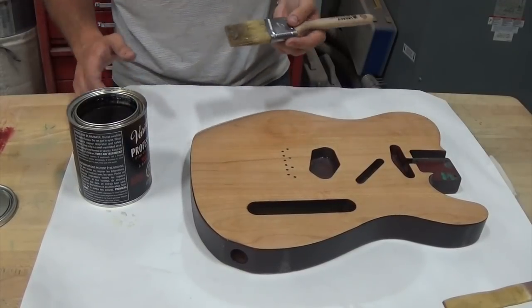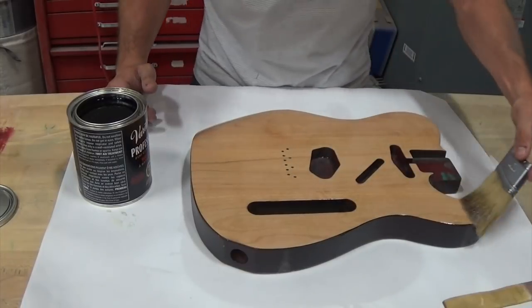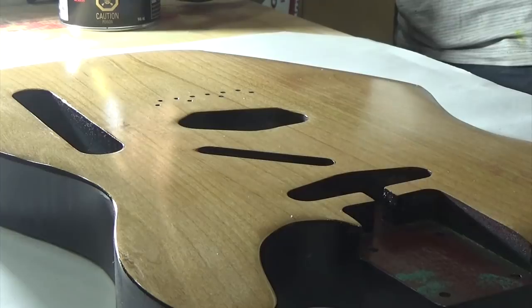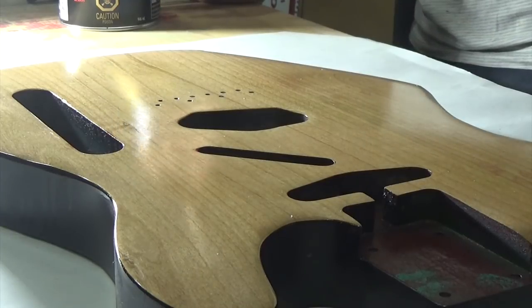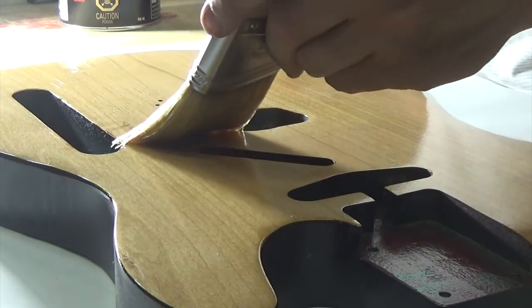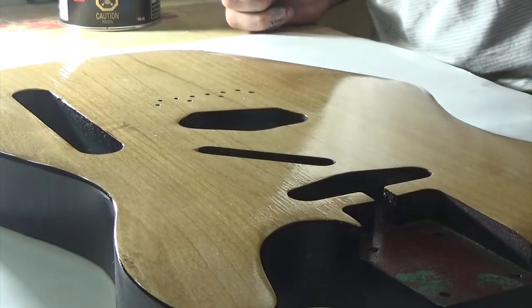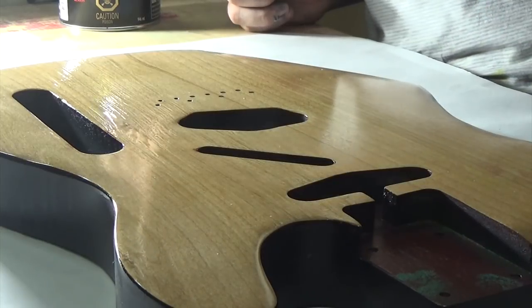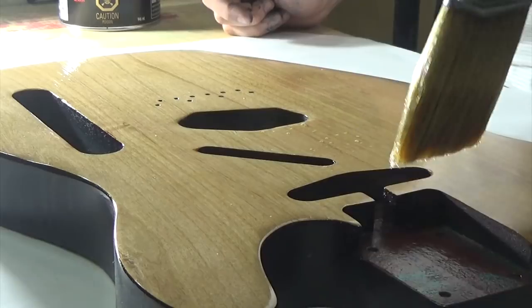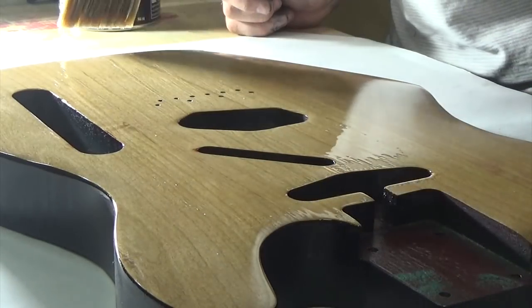Again, it's not a big deal for the long stroke part. It's not like if you're applying a lacquer finish, but it is helpful if you can avoid going over it, you know, an absurd number of times. But if you need to, you can. You can brush the bubbles out. You don't really have to tip off like you would with a lacquer finish. You can apply this stuff a little bit heavier and it kind of tends to self-level. So really, it's a fairly easy thing to work with.